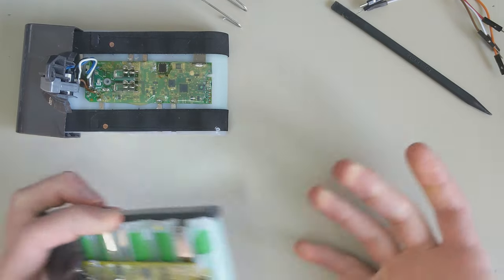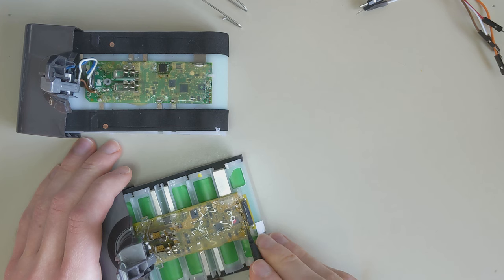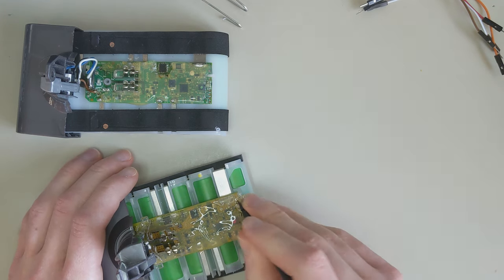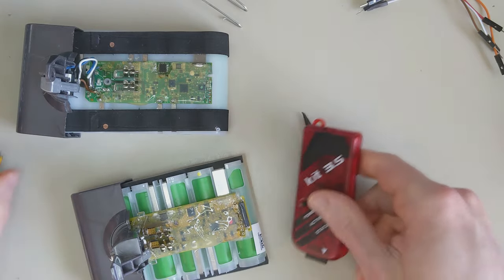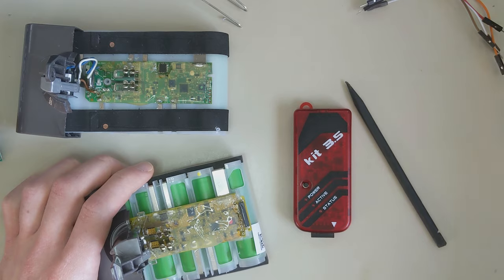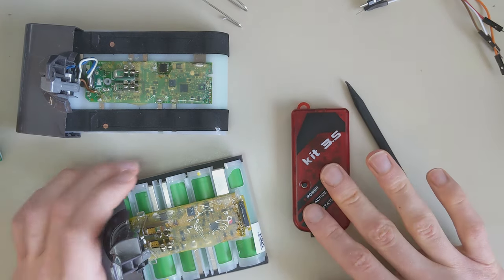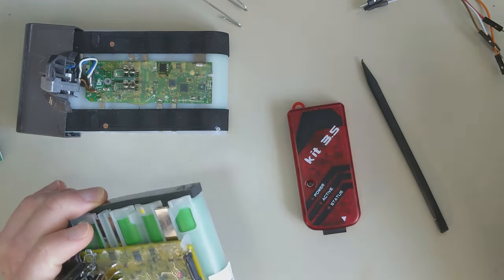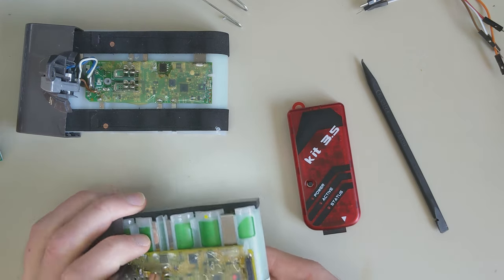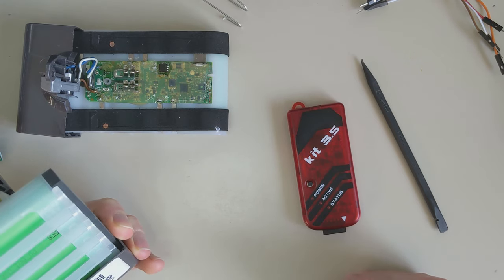So that about does it. We've taken one of the batteries, removed the plastic shell, scraped the conformal coating off the five contacts, shown the wiring diagram to connect our PicKit 3 or clone, how to download the program from Microchip, download the GitHub repository and hex code, get it connected, and download the firmware. And later if needed, you can look at your log of errors to figure out what's going on. I hope this helps — if you have any questions, open an issue on GitHub or leave a comment. Thanks for watching.